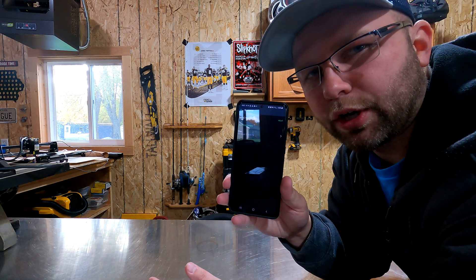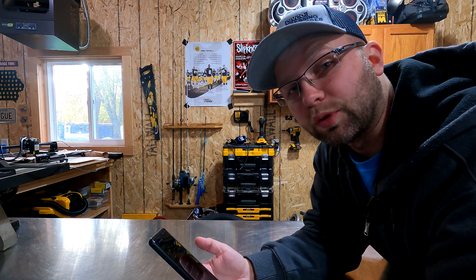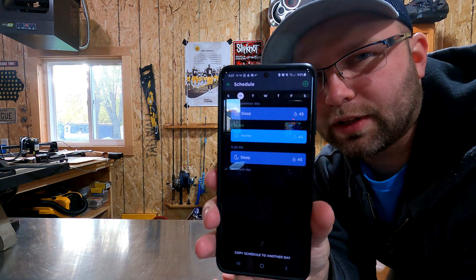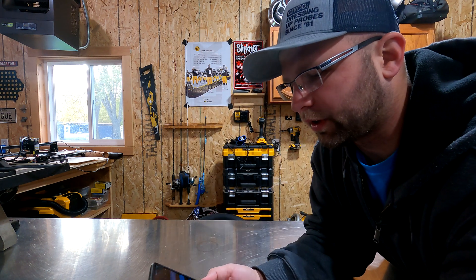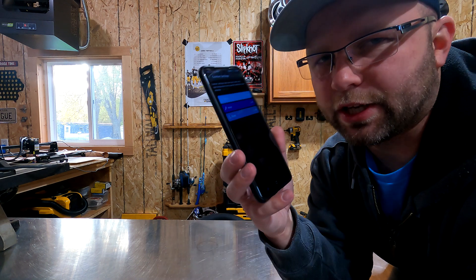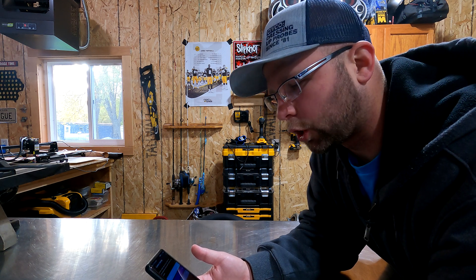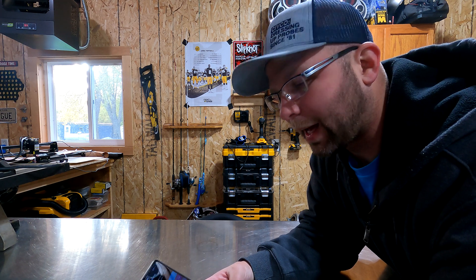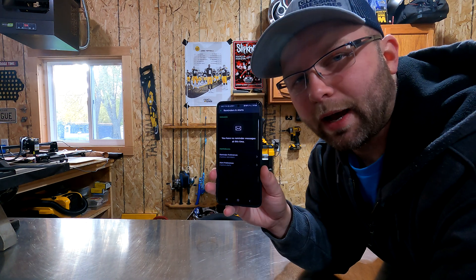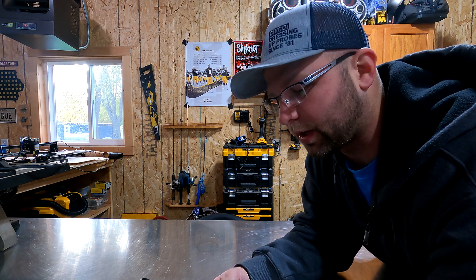You can set the fans around your heater to run every so many minutes if you'd like, and then you can add sensors if you'd like to pair more to the device. Since this is the Eco model, it only comes with the one sensor built in. You have different schedules you can build in if you're really worried about that for your garage. You can set your comfort settings — for home, away, or asleep — so when somebody's home it can automatically go to 65 degrees. You can also set reminders: I have one set so that if it's below 45 degrees it alerts me, because that means something's malfunctioning.